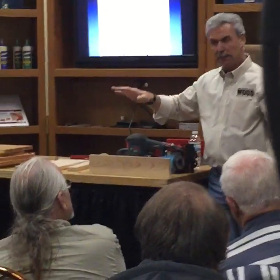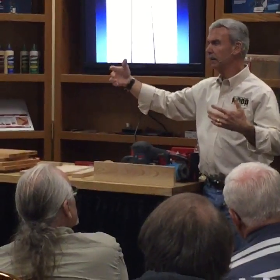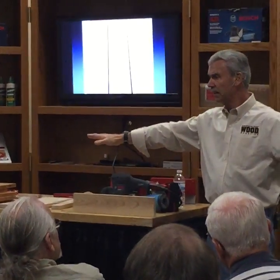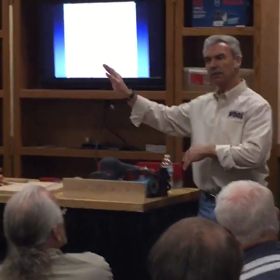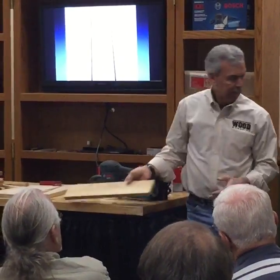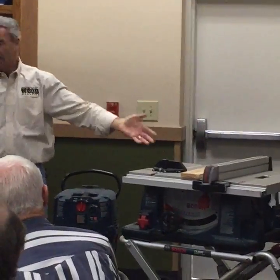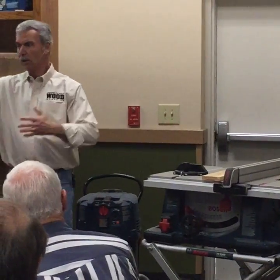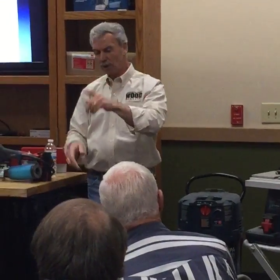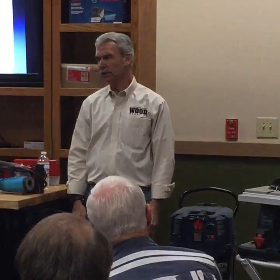So now you're trying to keep it from falling off here and trying to keep it from diving off the other side. And you can't use a roller stand or an extension, because unless they're as flat as that joiner top, they're either diving into or climbing out of that cut. Okay? So the issue is, it's really hard to do that. But if I have my table saw, and I've got an out-feed table on the back side, gravity holds it down. I don't care anymore about the outside edge of that. I just send it through, and that table saw blade cuts a dead straight, perfectly jointed edge on that out of a 2x10, 10 feet long, which I'd never be able to get in my joiner.